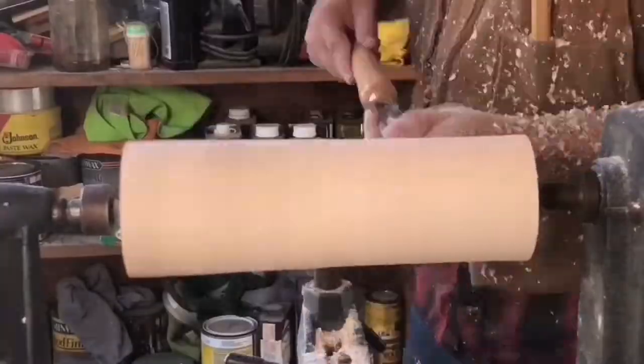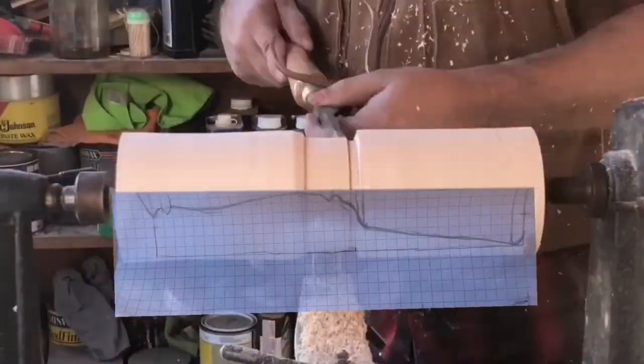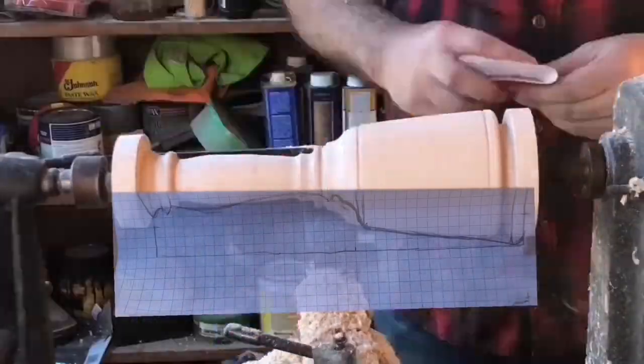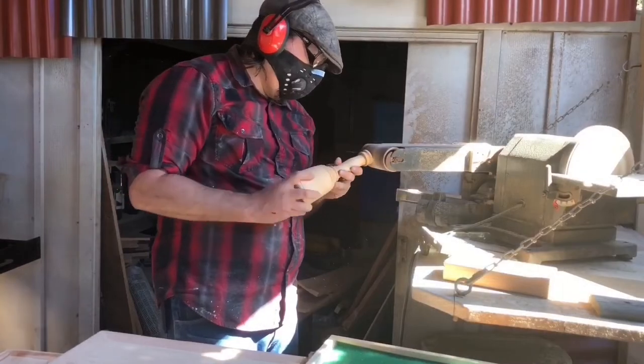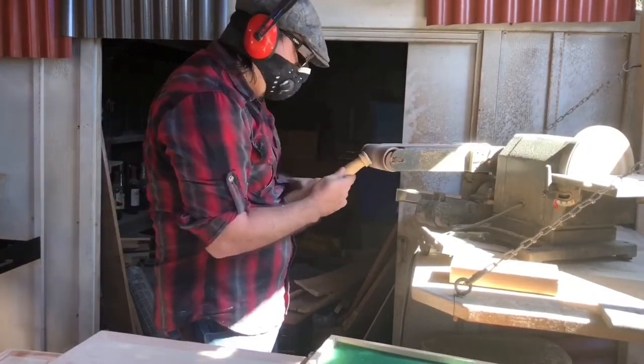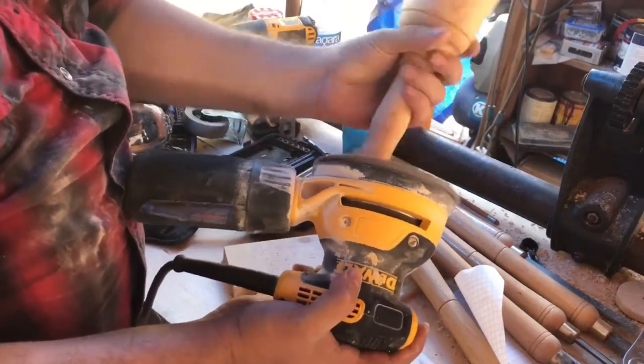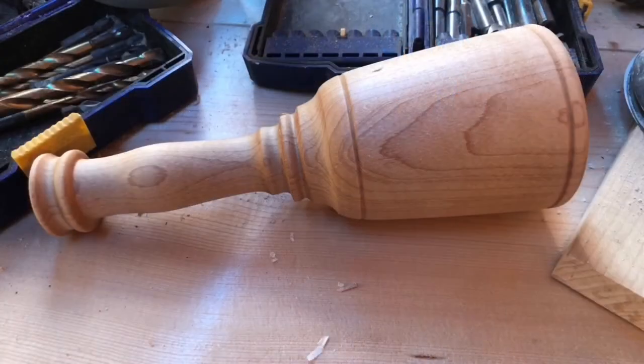Let's rewind real quick just to see how close I got to my original drawing. I kind of just thickened everything out because in the drawing it would have ended up being too dainty — I don't think it would have worked as a mallet, it might have broken. Then I domed off the pommel on the belt sander, and sanded all the saw marks away and put oil and wax on those parts. Here it is all done. All in all, I think this is a great first project to do on a lathe — it can even be simplified in the design to make it even easier, and you get to practice a lot of beginner techniques. I'm quite happy with this and plan on using it for a lot of my carving from now on.